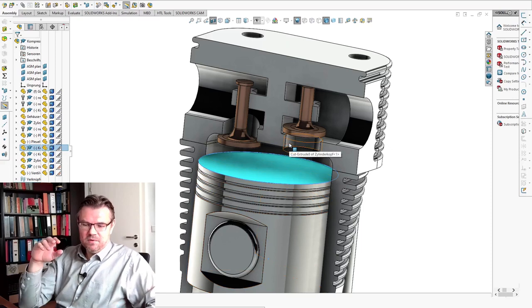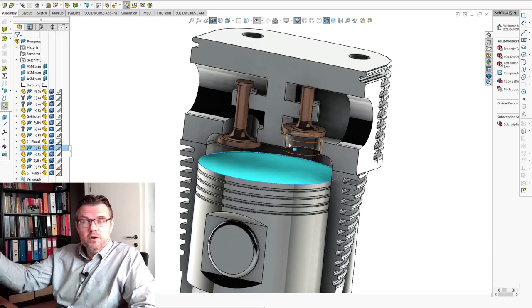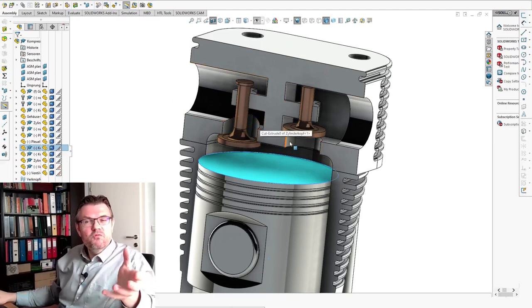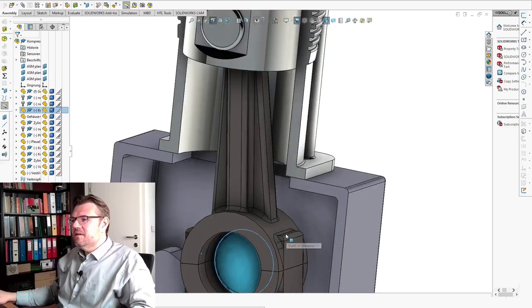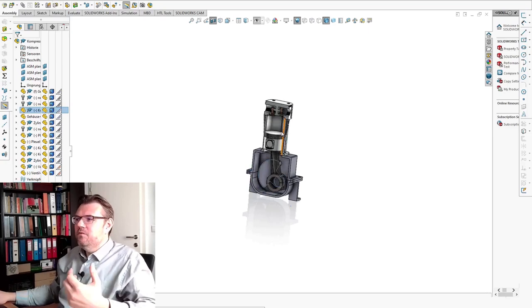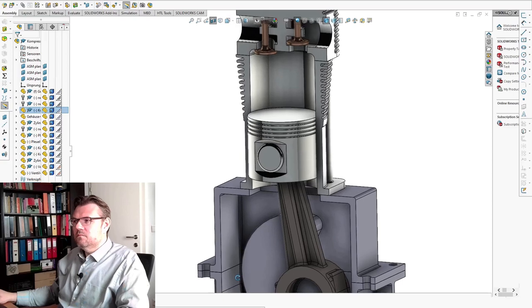We don't even need some camshaft or something like this, like in an engine, because the valves will open and close automatically, simply because of the pressure difference. Usually there are also springs which put them in a default position. However, there is no need of very sophisticated valve control. This is how this is working. Always one volume after the other to the other side. Piston compressor, a very usual thing.